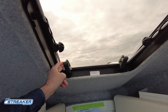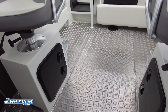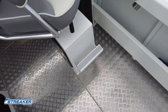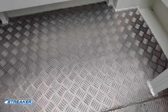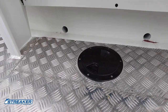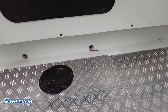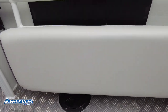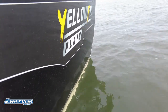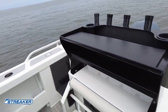There's natural light and an inspection hatch to get to the anchor or the bow of the boat. We've got aluminium seat boxes with storage, and they've also put two little steps on the back so when we turn the seats around and we're fishing, we've got somewhere to put our feet. Aluminium side pockets — you can see we've got the fenders and a bit of gear in there. It's a fully welded aluminium checker plate floor, welded the whole way across. Those holes are for the self-draining floor — any water on the floor will gravity feed down to the back, go through those holes, and straight out the transom, so you won't hold any water inside the boat. The boat's so buoyant it sits on top of the water, meaning the self-draining floor outlets on the transom are actually out of the water — so the water drains out and won't drain back in.